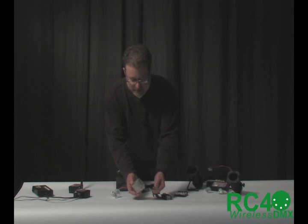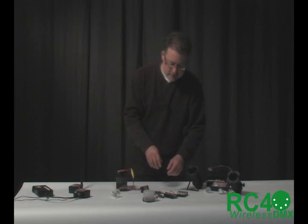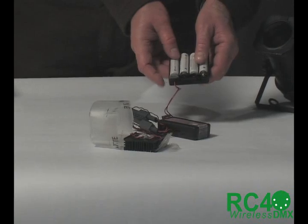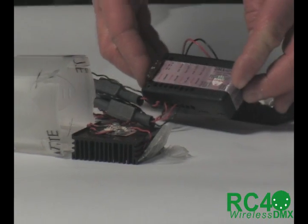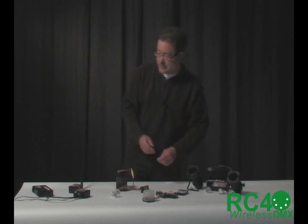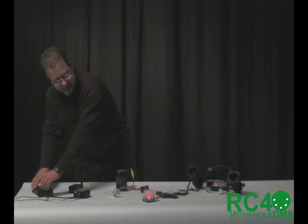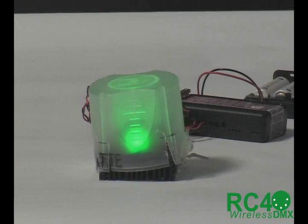It's like an RGB pixel in a signboard or a color source in various different fixtures. I've got the lid of a paint can to work as a diffuser — a little demonstration of prop construction here. Four AA batteries, very small and light, and our RC4 Magic DMX4dim dimmer. It has four dimmers, but I only need three: one for the red, one for the green, one for the blue. Here is my demonstration of the three primaries, controlled in real time from a DMX controller.